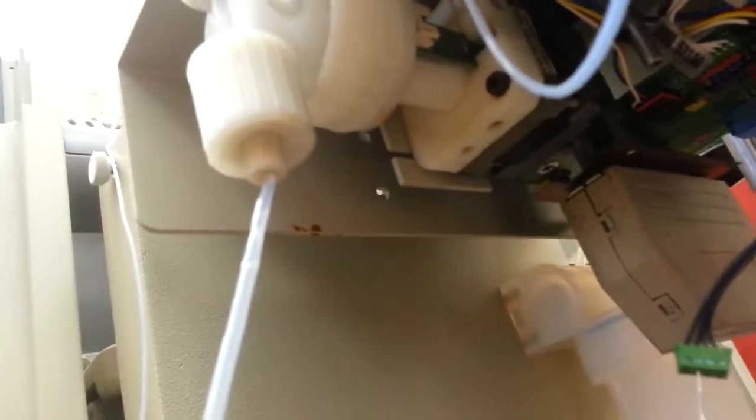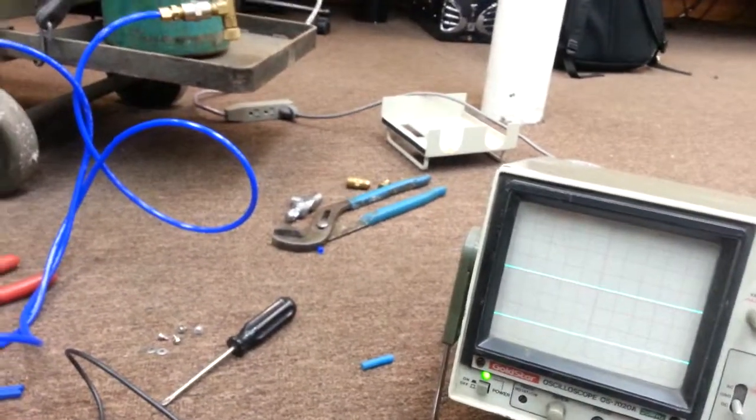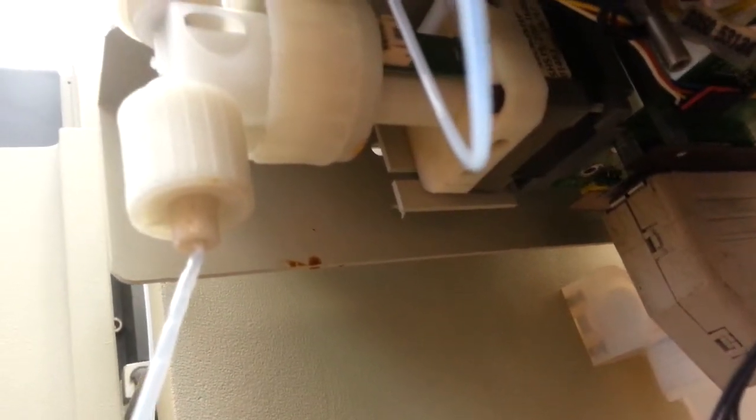Alright, so that's the rinse motor engaging. And so it is actually turning back there. It just doesn't know when to stop. So the moment that I ground out the input for the Hall effect sensor, see it on the scope here, switch direction. So that's a good sign, because we know, that's simple enough where we could probably figure it out.